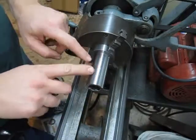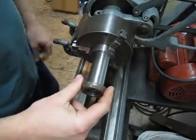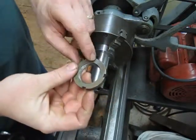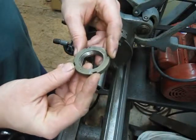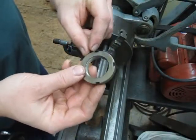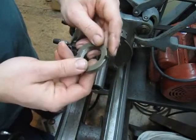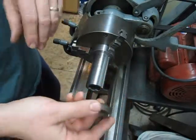So in this section right here, there's two bearings. This develops preload, screws onto the end of there. This got a little gnarled up. It's chowdered in a few spots. Makes me wonder if this came apart by somebody else, because I simply don't recall doing all this damage when I removed this. I used a punch, but yeah, this is pretty bad. But regardless, another day.